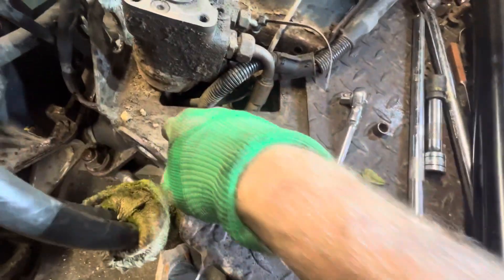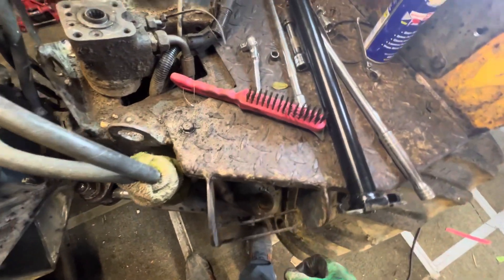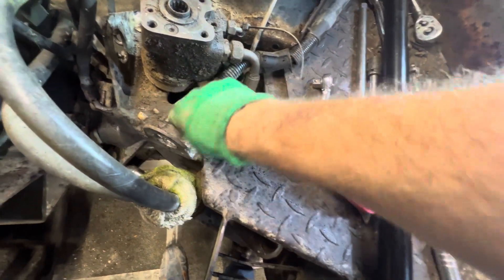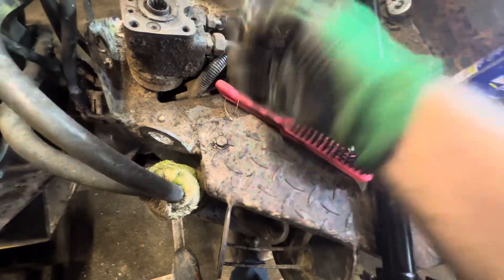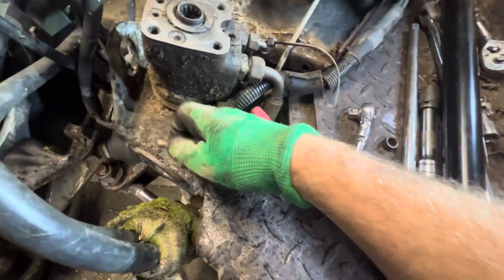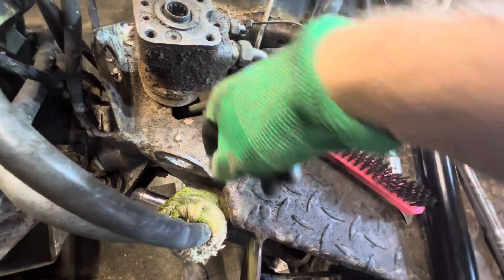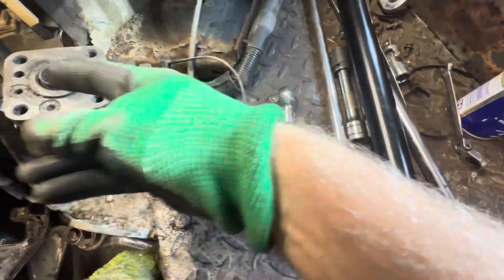A bit of bad news: I had three of four bolts out from the bottom there, but the fourth one sheared when it came off, and the shear was dirty — so I figured that was like that before, I didn't break it. They're reasonable size bolts. I'm probably at very least going to try and drill that one out and see if it'll tap nicely. Failing that, I need to re-tap it properly. Three bolts will probably hold it down, but while I'm here it seems crazy not to have a go. I'll punch it, drill it, see if I can put an extractor in there, or drill straight through and re-thread with the next size up.